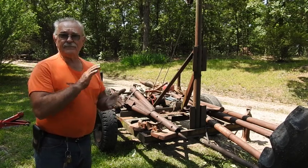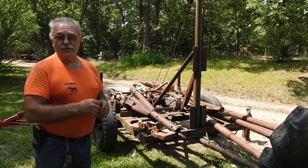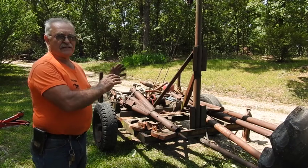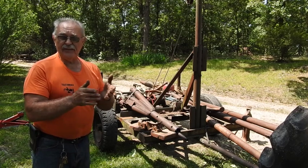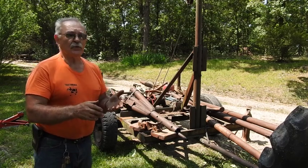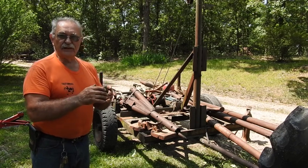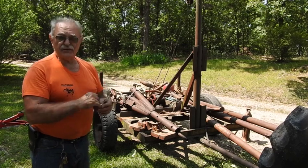This particular well we're going to pull today is my daughter's. She lives 500 feet up the road from me, and her well is 420 foot deep. If you'll stay with me for just a little bit, this video is going to be only about assembling the rig that I've put together for pulling this well. We've got PVC pipe in there, and it's much easier to pull, but back in the day this was all one-inch galvanized, and we had to build it substantial because with 21 links of 21-foot pipe, there's a lot of weight there.